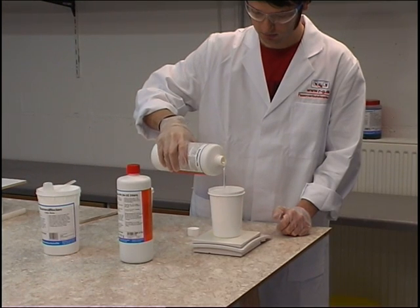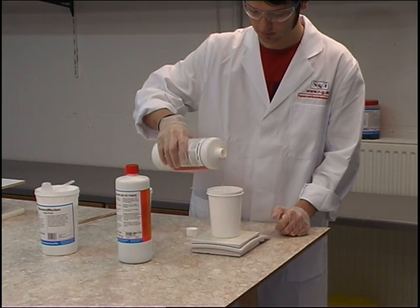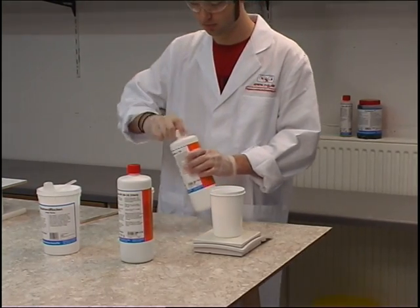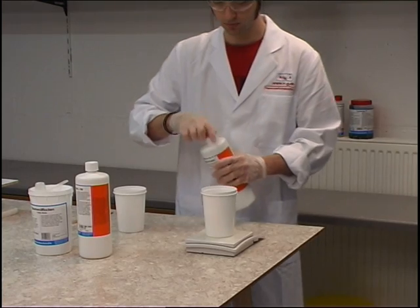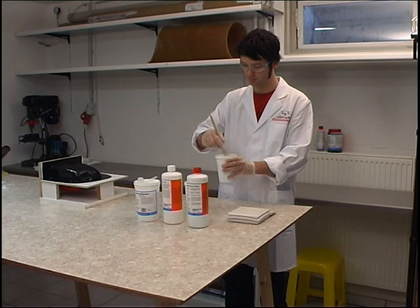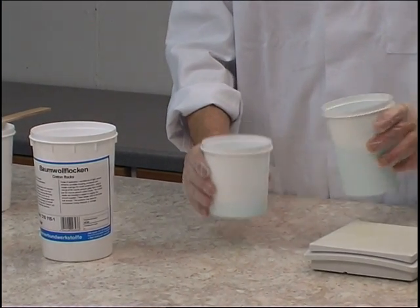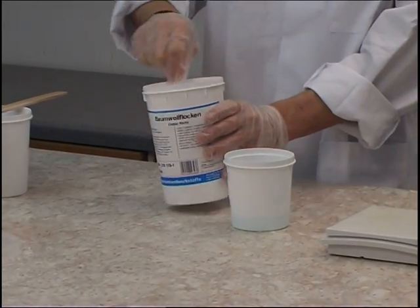The brush marks show whether the mould resin has reached the correct gelling state. In this case the mould is made up of several plies of glass fiber fabric. Low viscosity L1100 laminating resin is used and, in conjunction with EPH 294 hardener, has a very long processing time. As a measure of preventing the formation of voids within the corners and edges, a coupling layer of resin and cotton flock is mixed.